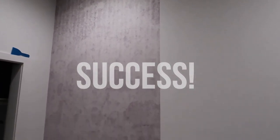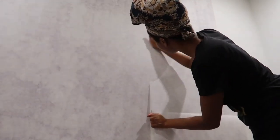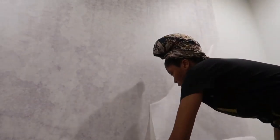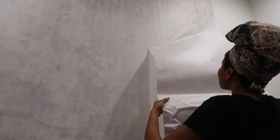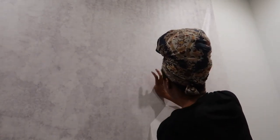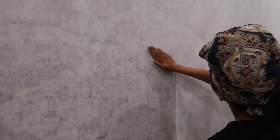The second, third, and fourth panels were super easy because they weren't by a wall, so I didn't have to worry as much about alignment. Starting from the left side to align with the right side of the last panel — this wallpaper does give you the option to overlap them without messing up the pattern. However, since I have a lighter color, when I overlapped too much you could kind of see it through, so I tried to make sure it was lined up properly.